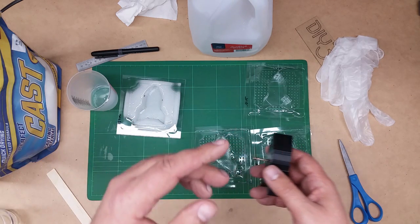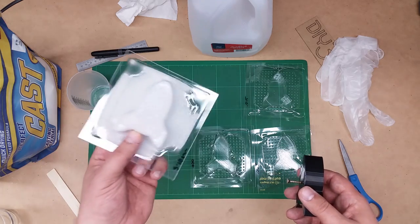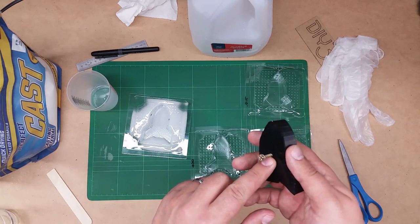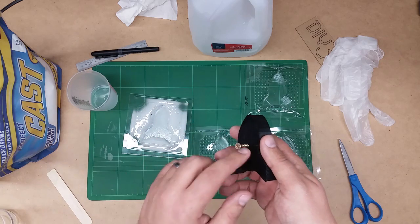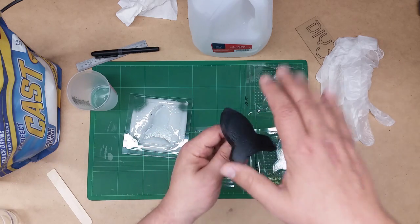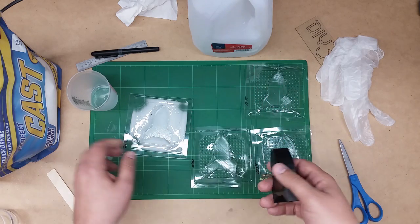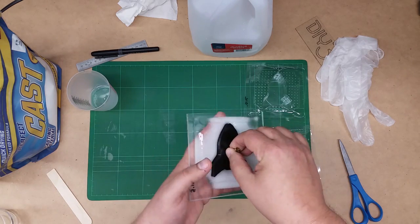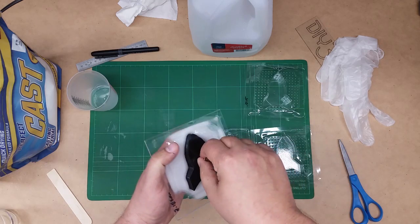One of the things, if you remember back to the prior episode, I was having a little bit of problems with the heavier plastic. One of the things I said I wish I did is put a hole in this. So what I did is I went back and I drilled the hole to put a screw through that I can tap a screw into. This doesn't stay in there when I'm doing the vacuum forming because obviously it lays down and the plastic goes over top of it. However, I did cast a much heavier piece and used this to extract the buck from the plastic.